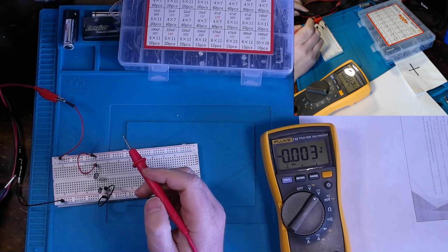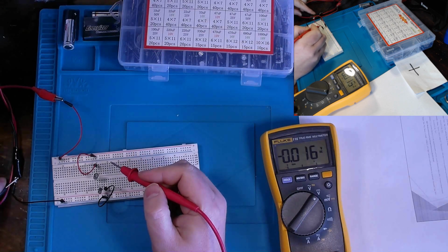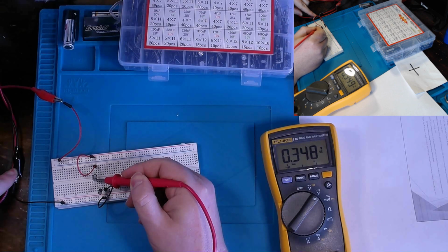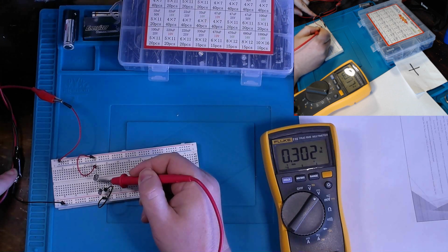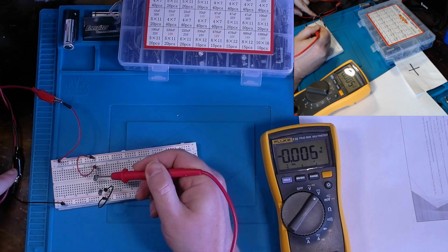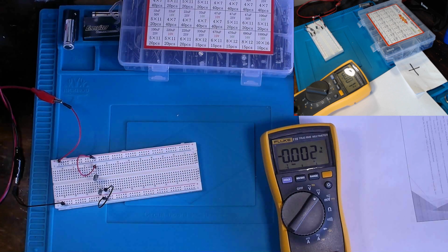And let's see if it went back to that entire 4 volt drop. Yeah, almost the entire 5 volts is dropped off that first capacitor because it's charged up. But I just wanted to annotate that real quick before we get into how capacitors behave in parallel.